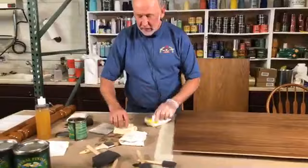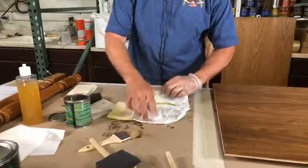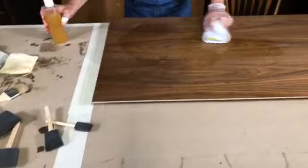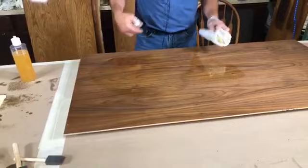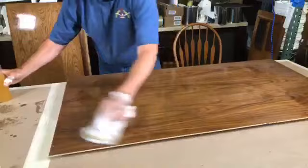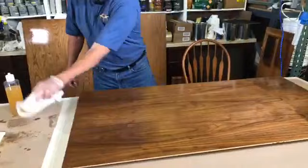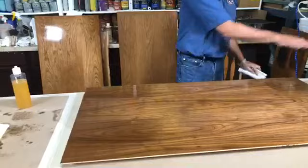Back to applying this product over large surfaces — this is where this applicator comes in handy. Another factor is speed. This is only a two-by-four-foot table; some tables are four feet wide and eight feet long, so you really have to move quickly. With this applicator I can get it on fast. This would be the third coat. Now I've got a nice even pad making smooth strokes, which is going to help eliminate the streaking.